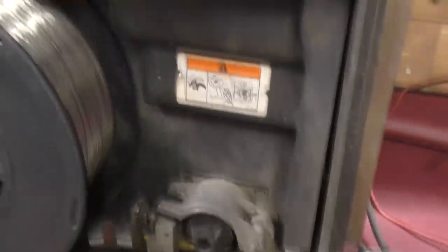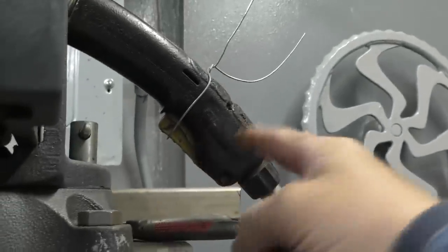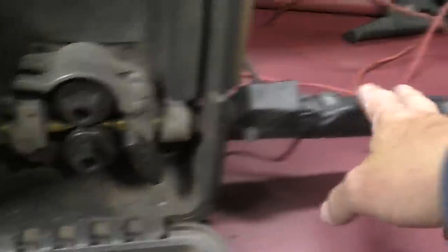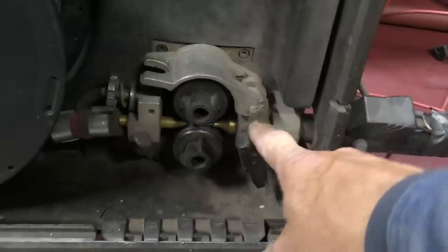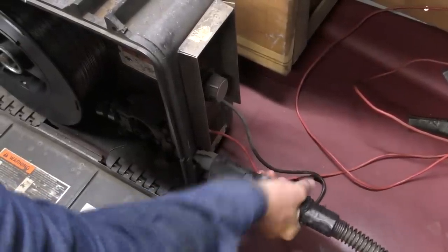That puts the problem inside the 12VS feeder. This is the part where you start thinking, am I doing something stupid? Especially on a machine I haven't used in almost a year. The spool drive is running, so we know it's getting power. We know the switch on the gun is working. There's no switch for turning the gas off — if you've got gas supplied, it opens the solenoid and lets it through. The gas flows down the umbilical, so let's check the umbilical joint.